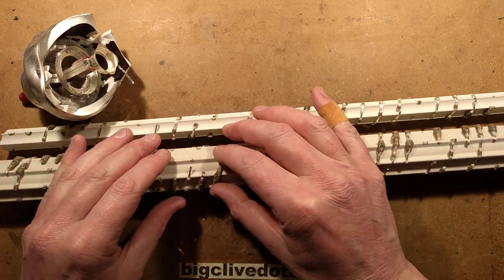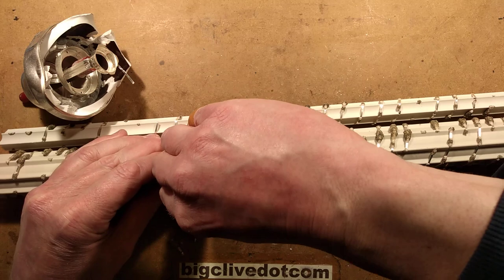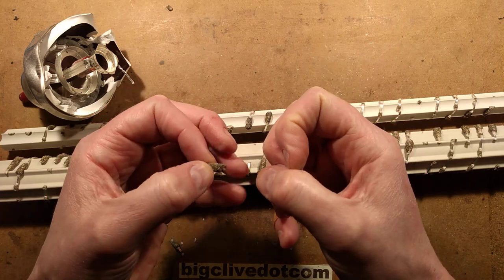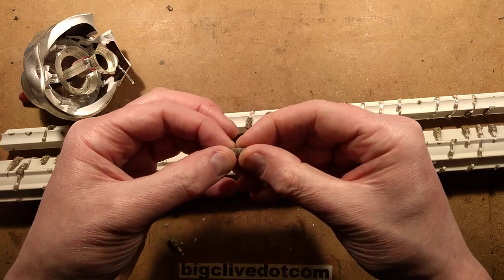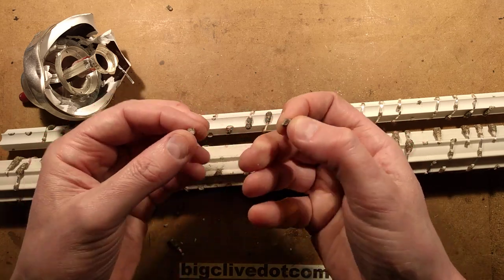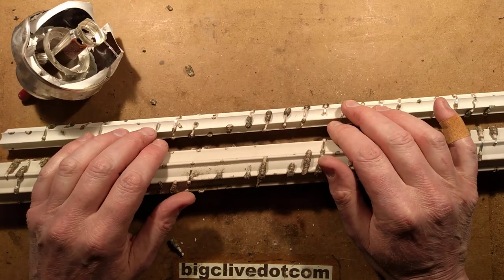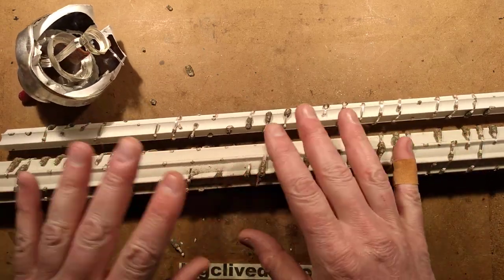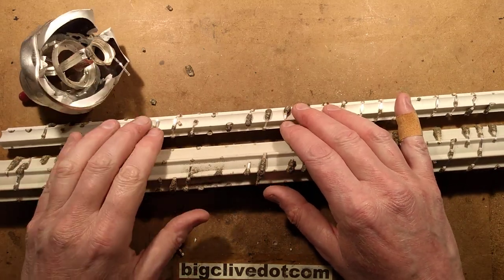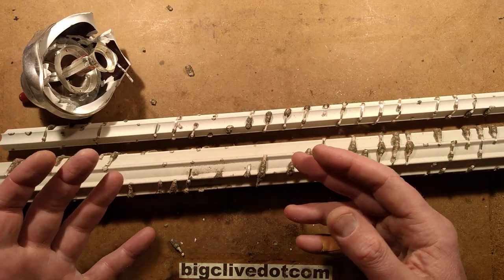The fuse has blown and fused into the silica sand. If I snap a bit of this off — there we go — where the fuse detonated and plasma started forming, the sand has flowed in and fused together into a non-conductive, brittle, glass-type substance. That's the magic of how it breaks the current. This fuse was rated at 63 amps, but rated for 20/36 kV — the 20 kV being voltage to ground and 36 kV being between phases — and it's designed to break 40,000 amps.